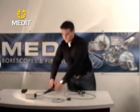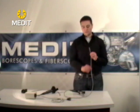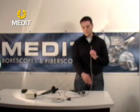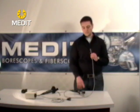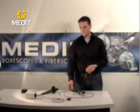These units feature fiber optic cables composing the image bundle running all the way through. If you damage any part of the tip or the insertion tube, you may notice that the image will be impacted. This is because these are glass lenses and you don't want to break them — it's not just one section, it's the entire insertion tube that is glass.